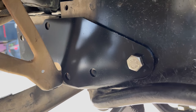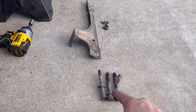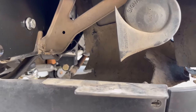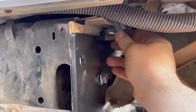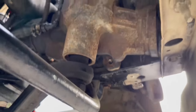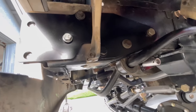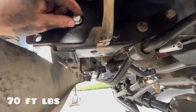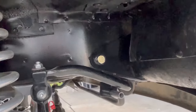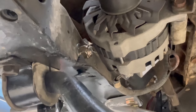This side in particular has three bolts that hold up the power steering — I had to remove those three bolts and the bracket holding up some of the plastic wheel well material to get to them. I'm getting those bolts bolted back up into the power steering. On the other side the big bolt is now torqued — I got about 100 foot-pounds on that one. The power steering bolts are all torqued up, and the last one is left loose so we can tie in the new bumper. The alternator side doesn't have a lot of clearance, but the length worked out.